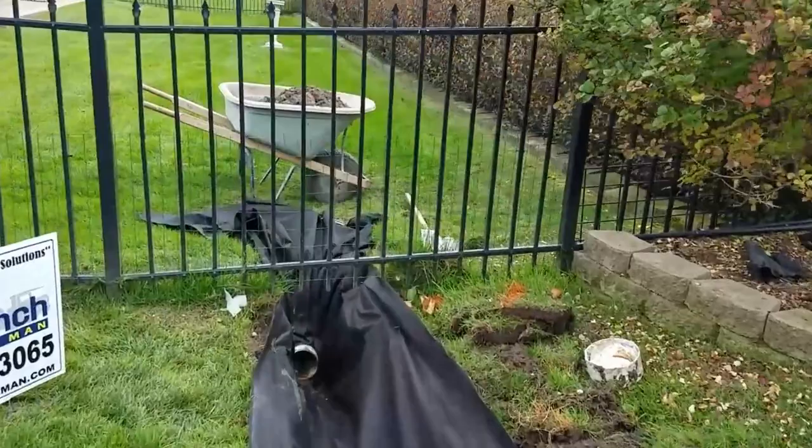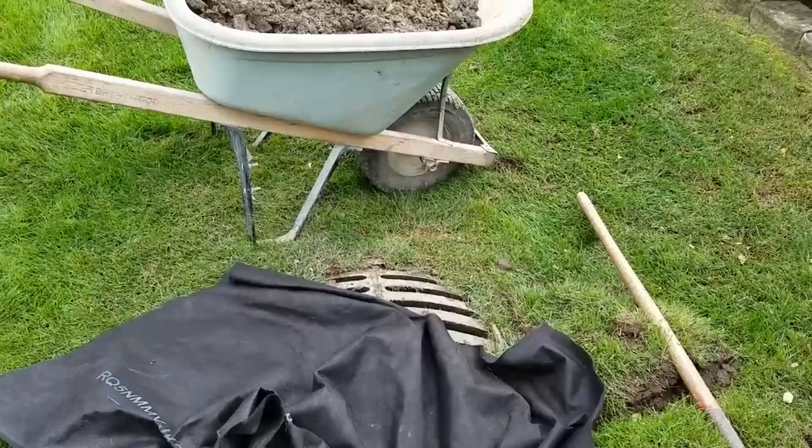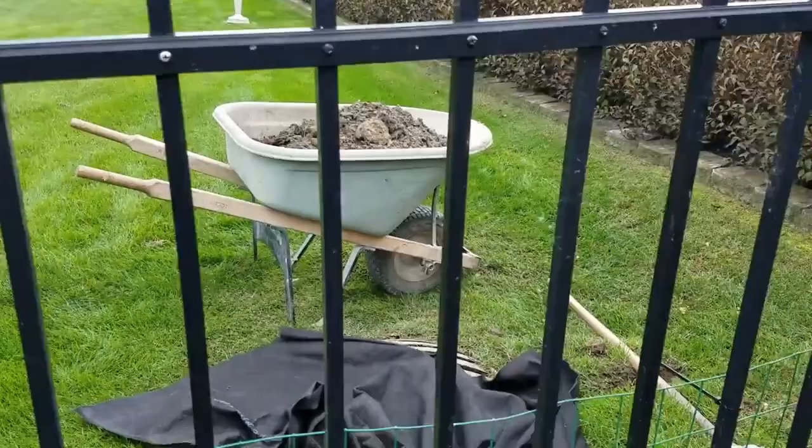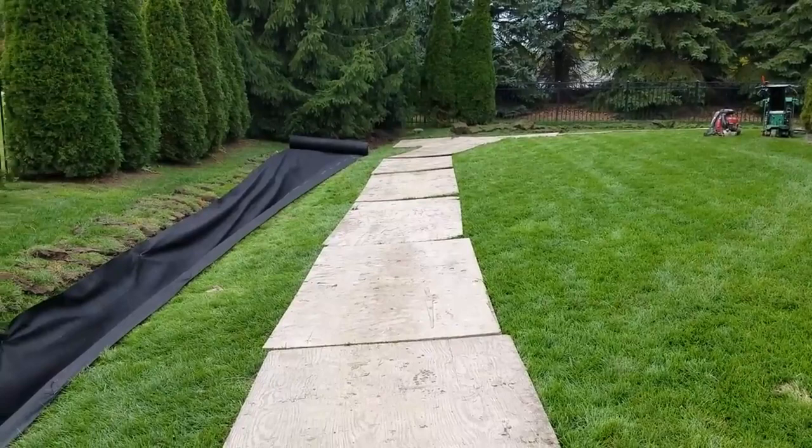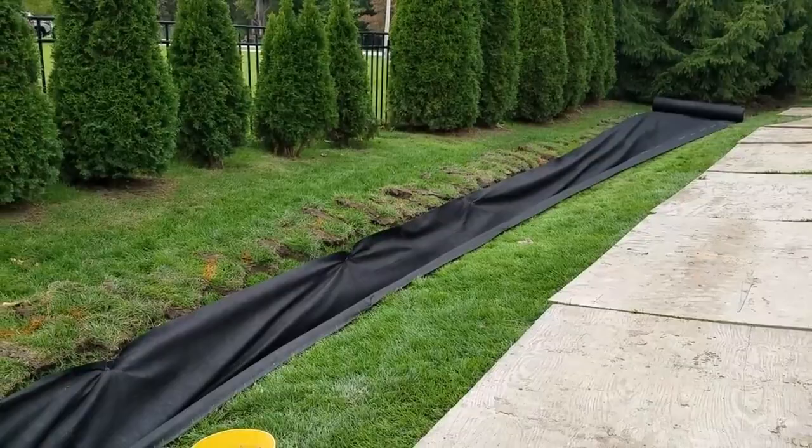We're taking this French drain system to a storm drain catch basin. We went through the sidewall of that storm drain catch basin. You can't expect the water to come up and out of the system through the grate of the storm drain catch basin — the laws of physics will not allow it. Water seeks level, so upstream the grade is higher over here than that storm drain catch basin grate, so some of the water would actually run out and over the storm drain catch basin grate into the storm drain catch basin.